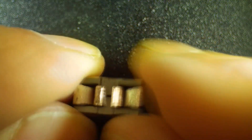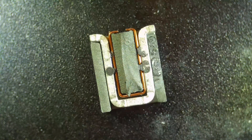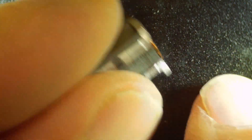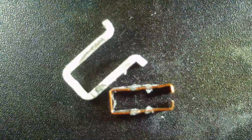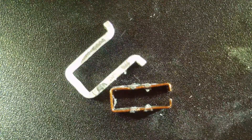It's got what appears to be four legs on it — I don't know how that works. I cracked one open and saw this U-shaped thing. Under the microscope, there's what looks to be silver — almost aluminum — a U-shaped thing, and then inside that is another little copper-colored thing. Cracking it open further, it turns out it's actually a transformer. They're three-quarter winding transformers, or you could call them one-turn. There's one loop, and inside that is an inner loop. The outer loop is obviously good for 100 amps because it's just a big piece of copper.